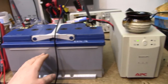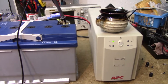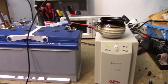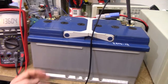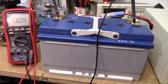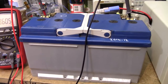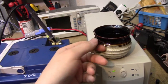These UPSs only have a simple battery charger — just a constant-voltage, current-limited charger with no multi-stage charging. If you're using one of these APC UPSs with a transformer, you should equalize your batteries every now and then — I do it about yearly. Just charge them up to about 15V per 12V battery and let them sit until the current stops dropping. That way you won't end up with a single sulfated weak cell that kicks the battery out prematurely, leaving you no choice but to replace it.